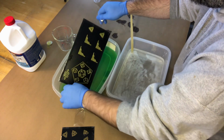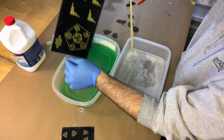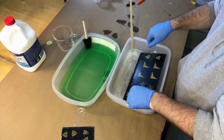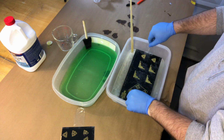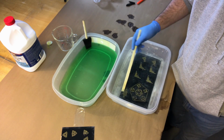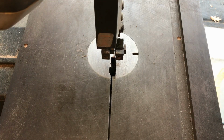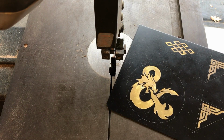So there I've just etched a plate. I kind of snapped over it, but you can see that the acid's actually turned green. The reason it's green is because the copper in the brass has actually dissolved into the acid, which is why that acid is now green, because it's absorbed some copper from the brass plate. So then, this took about an hour or two in order to etch this brass plate. I pull it out of the acid and I put it into the neutralizing bath, and I get what you have here, which is, it's hard to tell now, but it's an etched brass plate.